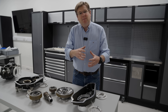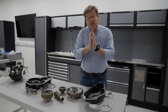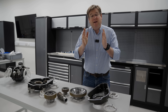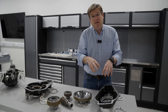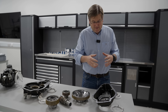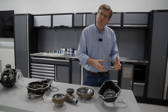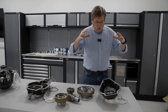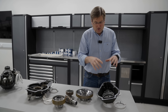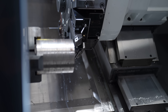In order to reliably make these parts so that when we come and measure them and when we fit them up to their adjacent parts, everything fits properly, everything seals, and the adjacent bearing races are all in exactly the right position, we've had to develop a whole host of specialist machining strategies, tools, jigs, fixtures, stress relieving and heat treatment processes. There's a whole tome of work that goes into just being able to make lightweight but stiff casings really, really well. And then of course there's all of the processes necessary to manufacture gears.